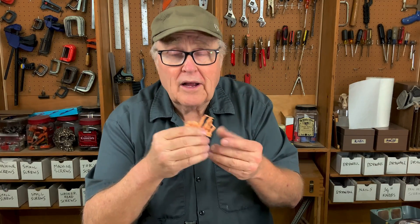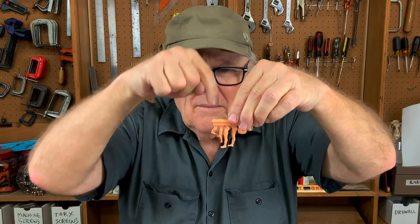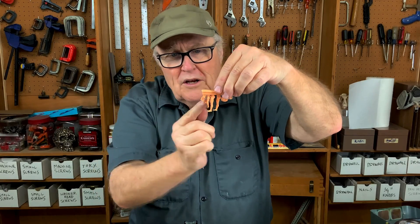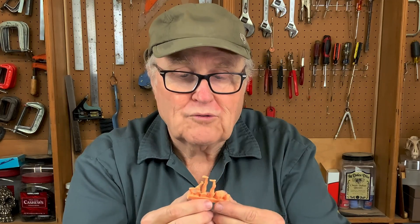You might ask why not use vacuum casting every time, and the answer is twofold. First, a lot of times you simply don't need it — if you sprue and vent a mold cavity properly it's going to fill without problems. Second, sometimes it doesn't work. These parts are pretty straight hanging down, so as bubbles expand under vacuum they go out the top with no place to get caught. But I have seen vacuum castings where a bubble expands inside the mold under vacuum, then when you release the vacuum it contracts back down and the bubble is still trapped under the roof of the cavity. So vacuum casting is not a one-size-fits-all solution, but in this case it worked really, really well.